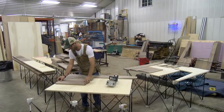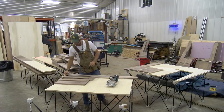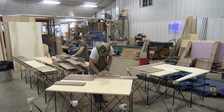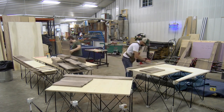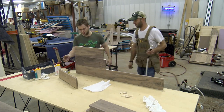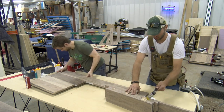We first started by building up and cutting to size the walnut boards to make the booth end caps. This was somewhat of a simple process, but the many steps and procedures we were going to use with the CNC machine meant we needed to pay extra attention to what we were doing. We used biscuits for all these panels, and to make sure I didn't put a biscuit where the CNC was going to cut out the shape, we used a few story sticks to mark out where each biscuit was going to go.